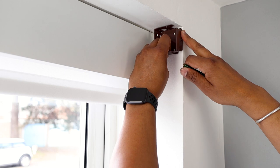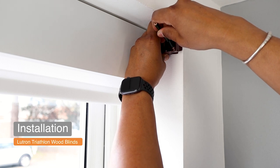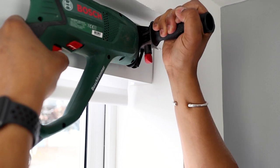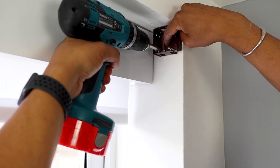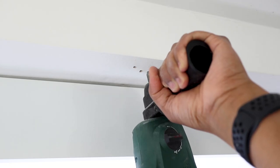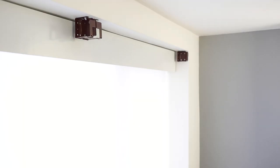I'm going to start by fitting my right bracket. First, using a pencil, I'll mark the holes I want to drill. I've decided to fit the bracket at the edge of the window to give the valence a bit of texture and to leave as much space as possible between my roller and my wood blinds. Once the holes are drilled, I'll fit my plugs and then screw my right mounting bracket. I'll do the same thing on the left to fit my left mounting bracket, then complete the job by fitting the combined right-left mounting bracket right on the window center line.